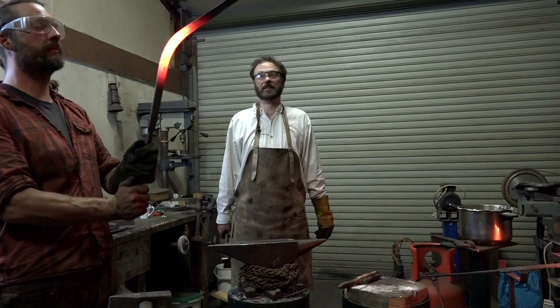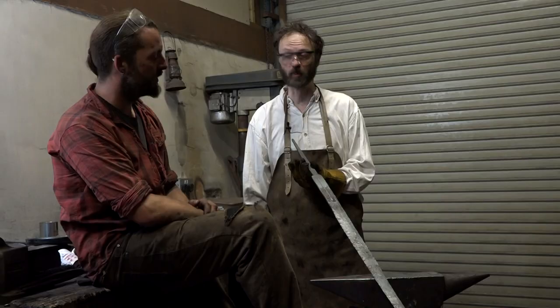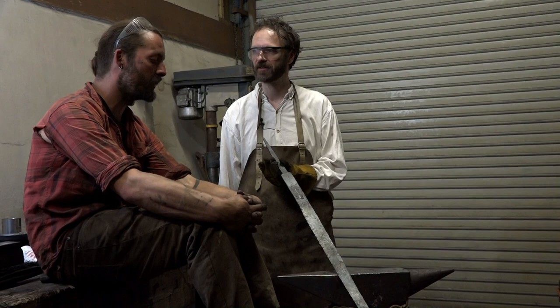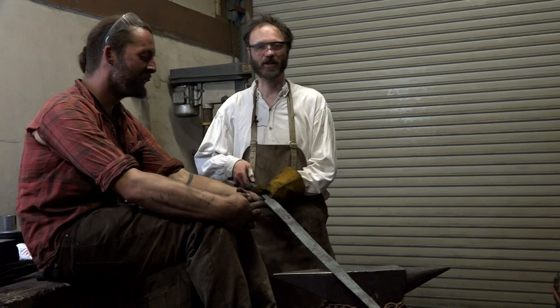Ta-da! We're not cheating with the bevels, are we? We're not cheating. Because there are some people who... How do they cheat? They grind the bevels on. But why do they do that? Because it takes a lot less skill. Right. So if you want to show off that you're doing it properly, hammer the bevels until they're jolly well beveled.